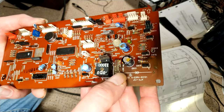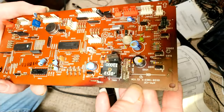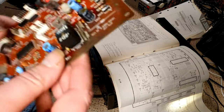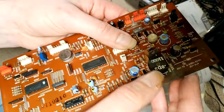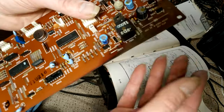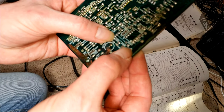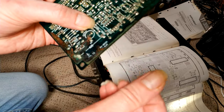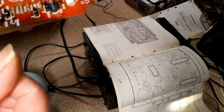So, remove the battery. Yeah, it's fairly good. Oh, that's broken. I'm going to have to replace that. That's actually rotted through. So, yeah, I'll need to change that. That one I'm not so worried about, because that's just to the battery, which obviously doesn't matter anymore. But that does matter. So I need to solder a new link in there, so I shall do that now.